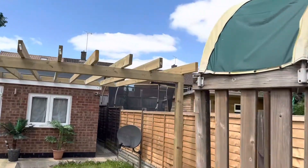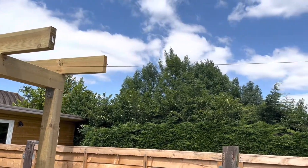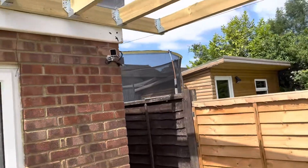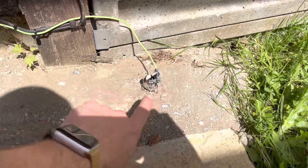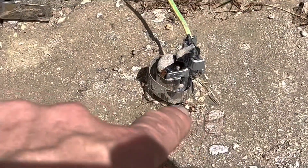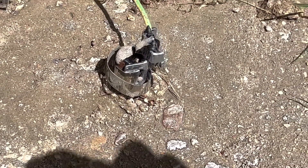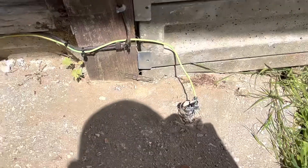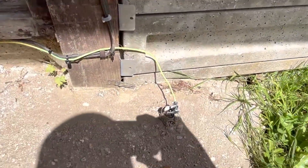We're busy doing some buildings, so the antenna may have to be repositioned slightly, but right now there's nothing happening. One thing quite important about AM radio is you've got to have a good earth. So I ran a separate cable — I bought an earthing rod online, one of these places. This goes about four feet into the ground — a copper rod — and it's connected to my earth cable. That is purely for the transmitter, which is also going through the earth cabling along with the satellite. It's not earthed to anything else.